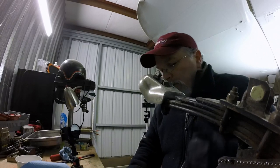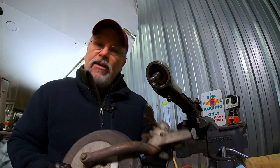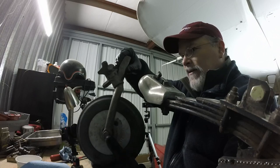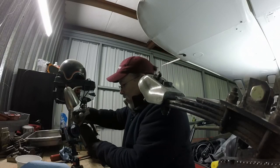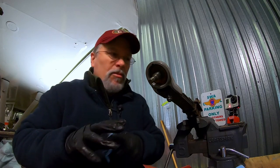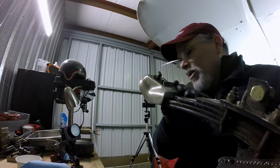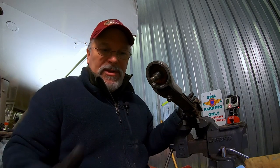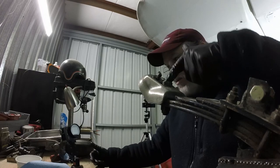So, the Scott 3200 was not originally installed on Stinsons. However, the Maule, which I have a copy of over here, this is the Maule tailwheel. It's a little more, well, shall we say, dainty. So this is what would have originally come on the Stinson. A lot of these I know were changed because of issues with these being abused, them wearing out, and not being rigged properly. So they get a lot of shimmy out of them. So there was a lot of recommendations to start using the Scott 3200s because they were available and probably a little bit more tailwheel than the airplane really needed, but the Maules were just kind of a little less than what the airplane needed.